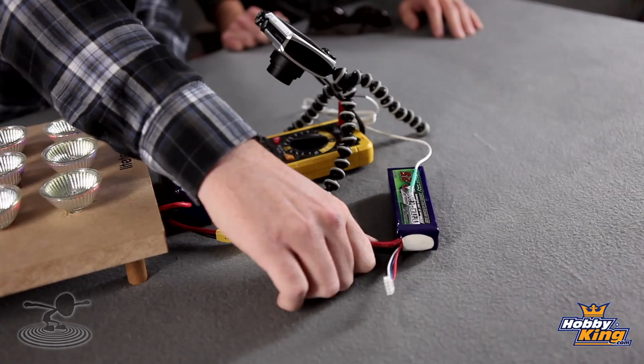That's hot. Connectors are hot. And it's not puffy — that held up really well. The wires are so hot — the wire actually almost looks darker than red. As far as I guess we'll find out time-wise how long both stayed lit, but the one thing we did notice is it delivered more watts, more amps, and temperature was less. It held voltage better. It performed a lot better. It's going to be really interesting — we'll see the results from this camera, compare the data. It didn't puff, it didn't get as hot, it delivered more amps and held a higher voltage.